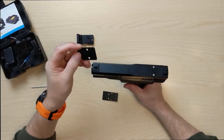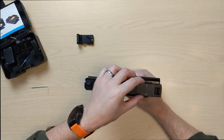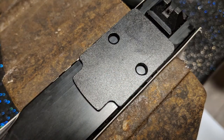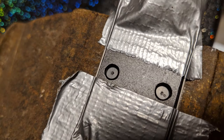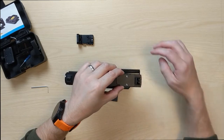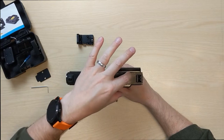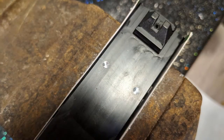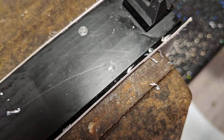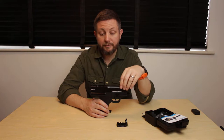And how I did it, this plate here is for an RMR mount. It's a spacer for an RMR mount. So I put that where I wanted it to be on here, taped it down nice and secure, and I used a center punch to create two punched points there, so I knew where to drill. Once I knew where I was going to drill, I took that off and then used the drill bit to drill the hole. I can't remember off the top of my head which size drill bit it was, but I'll put a note in the description saying what it was.